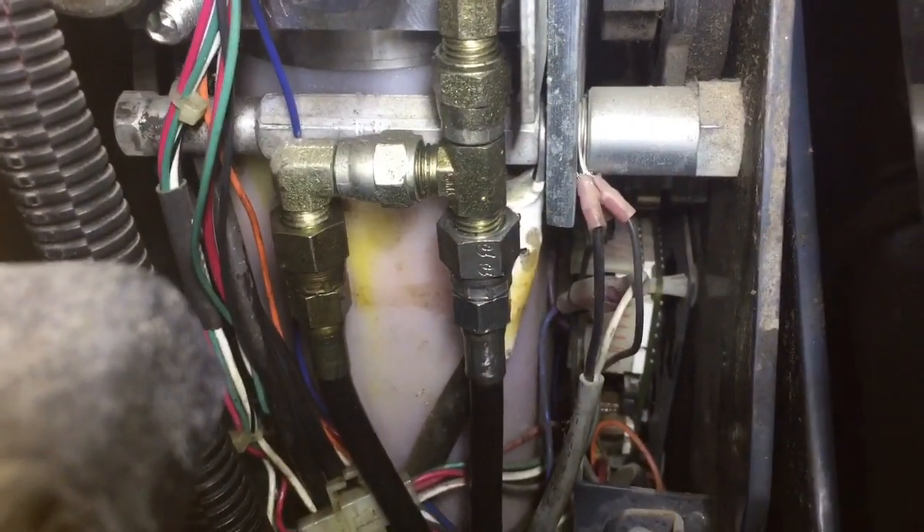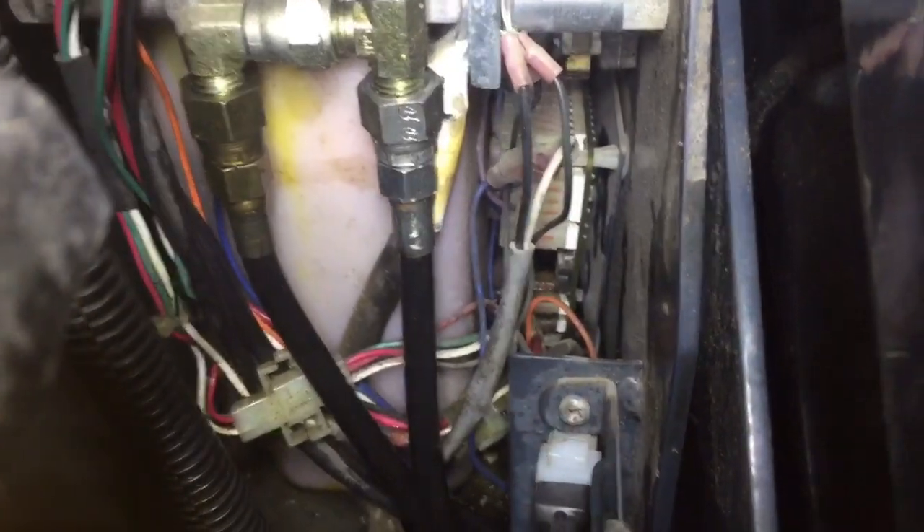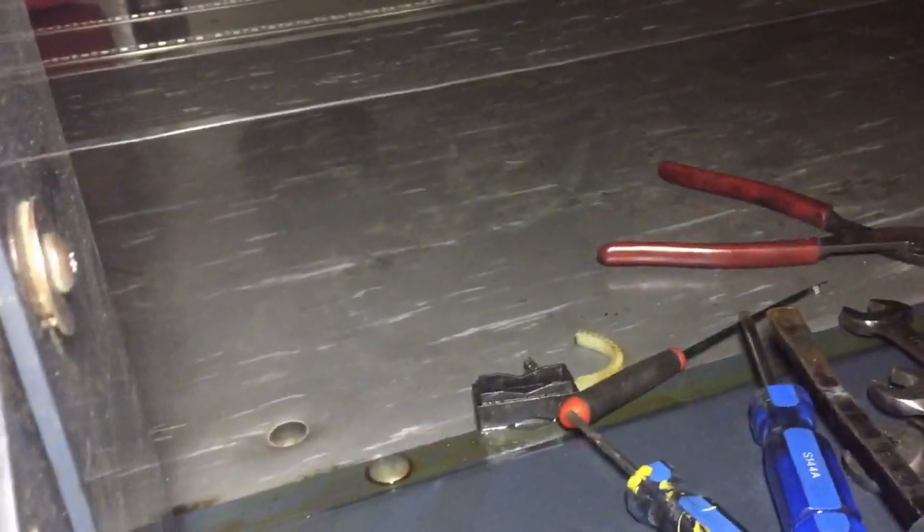We went ahead and stopped the leak. As you can see, that little silver-grey hose — that's the one we replaced. It was actually leaking from right there, where the hose is pinched — where the metal ends and the plastic begins, that's where the leak was. We pulled the old one out and threaded the new one in, cycled the lift, got all the air out of the system, and it's running properly. Now I'm just going to fill up that reservoir tank, make sure it's full, put the cover back on the motor, and clean up the oil on the floor — and that should be done.